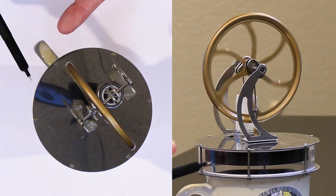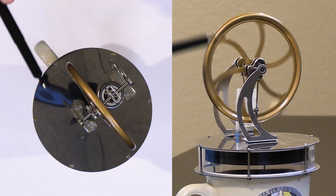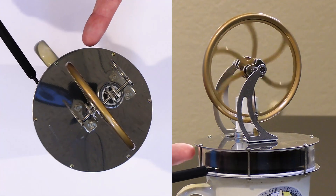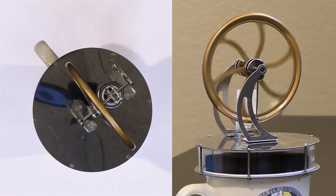What's happening is we're heating the air underneath this moving member. As we heat the air it wants to expand, so it pushes the bellows up and then pushes the push rods — there's two push rods, one on either side — basically pushing up and turning the wheel. As the flexible member on the inside gets to the cold side, it cools off and that cooling effect gets transferred back to the air inside.